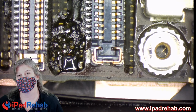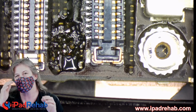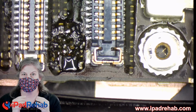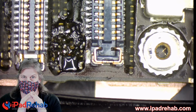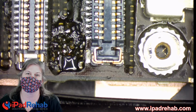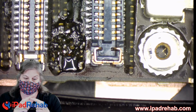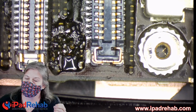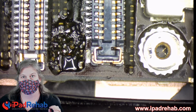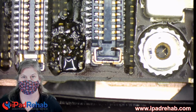So our theory is, what if we apply a small voltage to the short? If we think about what is the short anyway, right? The short is going to be inside the CPU, a thin wire is touching ground when it shouldn't be. So what if we applied some energy to that system? And when you apply electricity to a system, what gets hot? The thinnest wire. Well, in this system, the thinnest wire would be the part that's not supposed to be touching ground, in theory, right? So if we applied, on purpose, a little bit of electricity into the short, could we burn the thin wire so that it stopped being short and returned it to the native state?